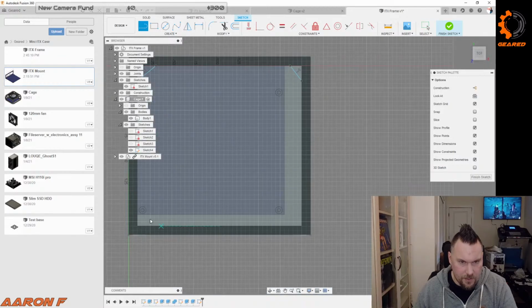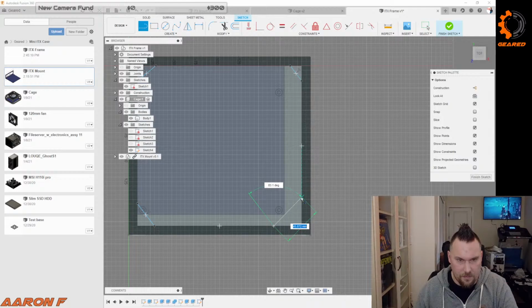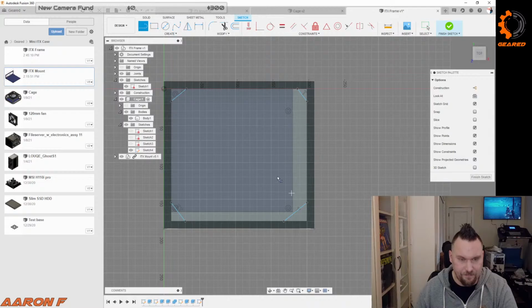So that did a perpendicular constraint. Nice. If I actually take the time to watch that, I can get these kind of pre-constrained. You see there in the middle, that perpendicular constraint's coming up, and it's showing you what it's perpendicular to. The line to the left highlights with the perpendicular constraint that the automatic constraint is showing you. So that's what we're constrained to.